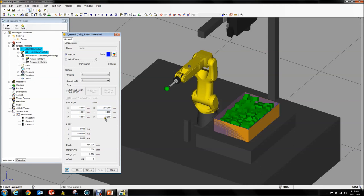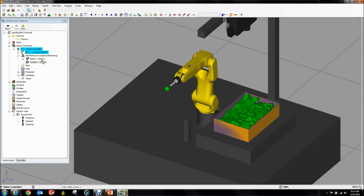They're not terribly hard to put in. If you do this on a real robot you can do this two ways: punch in the numbers by hand, or put a pointer on your robot, point it to the corner, and there's going to be a Record button — hit Record. That concludes this bit.